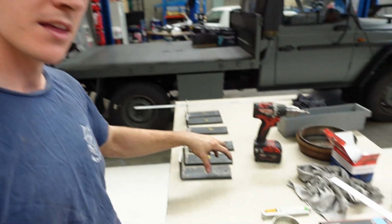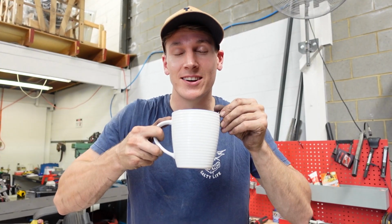Now it's pretty much time to bolt these onto the chassis, ensure the fitment's correct. Then I will start working on tacking them into place and also getting the slider position ready for those tube cross member braces to go between these and the rock slider once I've positioned the slider into place. It's all coming together, slowly but surely. There's a lot of work that goes into bar work, guys, heaps of work. Everything's custom. That's why you pay so much for bar work, especially if it's Aussie made. It's going to be so worth it.